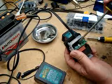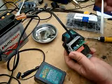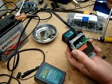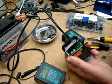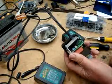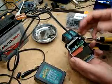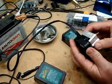On the board, there's an LED, which I know works because it blinks. There's some resistors. When they go bad, they'll be burnt or gone. There's some IC chips that no telling what's in there. No way of replacing that. A few other odds and ends. The only part that I had a replacement for, other than the resistors, which weren't bad, was the electrolytic capacitor. And I also know that electrolytic capacitors have a habit of going bad after a number of years. They just dry out inside and they quit working. So, with nothing to lose, I decided I'm going to try changing that electrolytic capacitor.